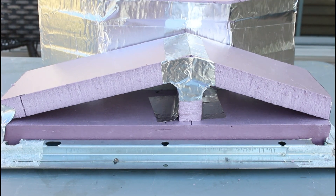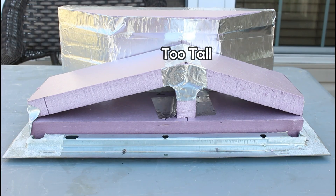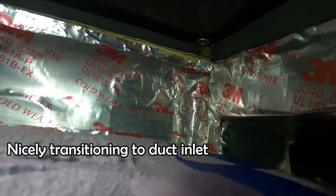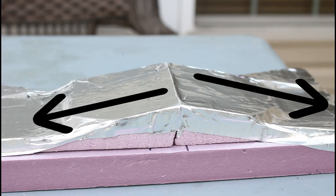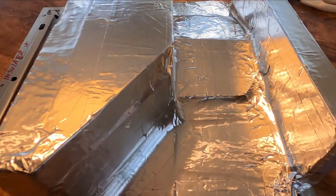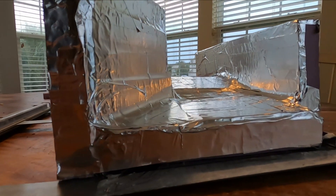Moving on to the cold air section. I built an airflow guide, but it failed the fitting test — the guide was too tall to fit in the chamber because of the bottom layer of the board. I changed the air guide profile. Now the end of the slope is nicely connected to the duct inlet. By flushing the bottom insulation board with the duct inlet, the air would flow into the duct smoothly and efficiently. I raised the apex of the guide closer to the chamber ceiling but leaving enough room, as I worried that being too close could create unwanted back pressure on the blower. The fitting test went very well. I covered almost the entire surface with foil duct tape — maybe I went too crazy, but I just didn't want to leave room for debris peeling off the edges in the future.